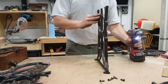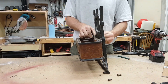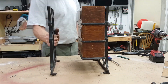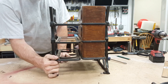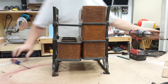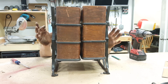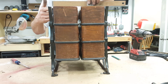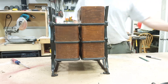I'm going to put the shelves back on and see where the top is again, to find out right where I need to cut that cast iron to make the top line up perfectly. I'm using a straight edge to find the top of the shelf and make sure that when I put the cap on there it doesn't stop the shelves from coming out.